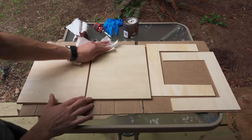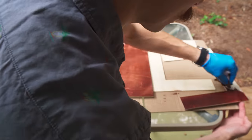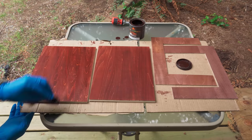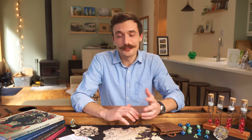Just make sure to wipe the wood down with a wet cloth first to remove any dust. The closer we get to the end of this project, the higher the stakes, because any mistake we make now will probably show up on the finished product. Grab an old shirt or a bed sheet to use as a rag and wipe the stain on as evenly as you can, working as quickly as you can. Water-based stain dries quite quickly so you want to get an even coating over the whole face before it dries. If some of it dries and then you wipe over it again, you'll get darker patches. If you've never used stain before, I would definitely recommend putting a few coats on some offcuts to experiment with what works best for you. At this point we're just doing the faces and the inside edges of the front pieces — we'll do the rest of the edges later. I went with one coat of stain, except on the front panel because I was trying to cover up a mistake with a second coat. I forgot to do the inside edges of the front face and then tried to carefully go over them again, but it left a dark streak. The second coat didn't fully cover the mistake but it made it less noticeable. Ideally, just get everything on the first coat.